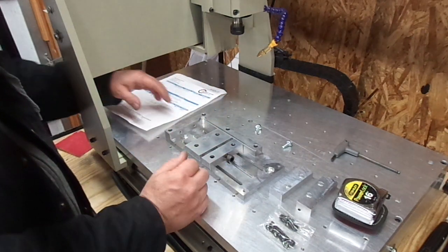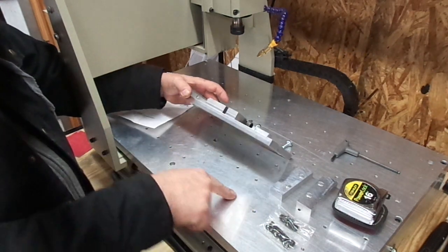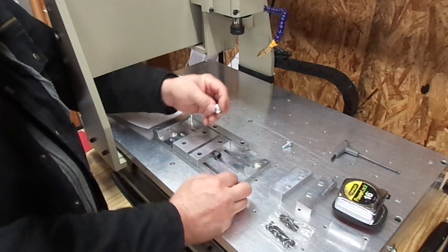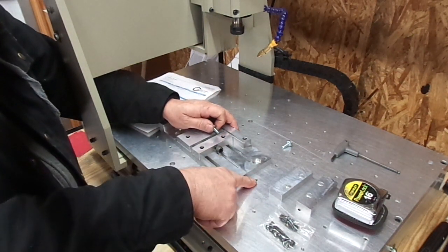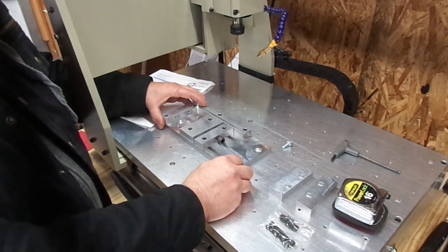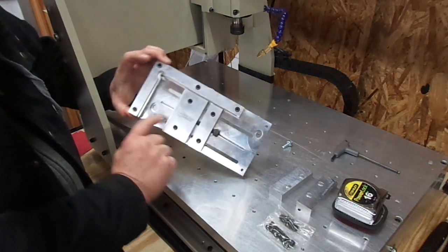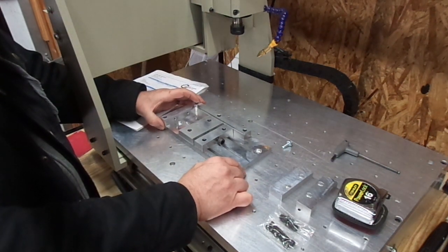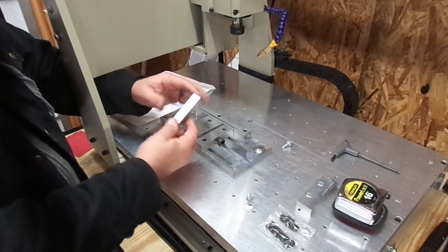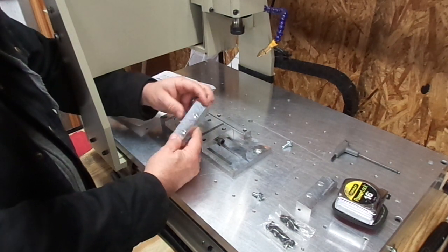You may limit your ability to come across here with a bit, but they even say in the ad that this section is sacrificial and replaceable — so if you had to, you could cut into it. It's a standard 2x2 layout grid, which is what I have on this table. My table is M6 by 1 thread, so I can take some flange bolts and bolt this onto the table, which gives you a little room to position your part.